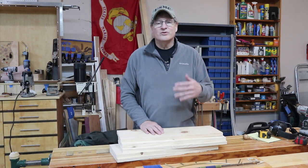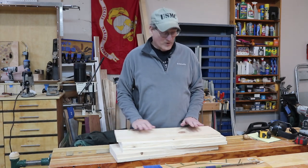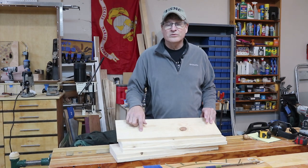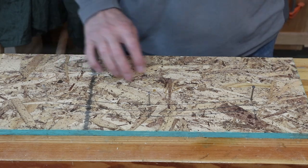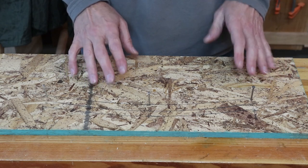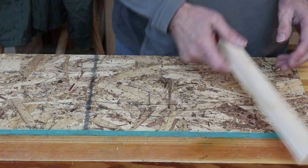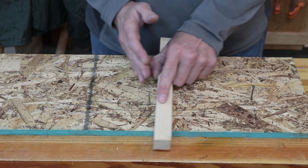I've already done some initial sanding on the edges since they were rough. I'm going to come back and route the edges to make them nice and soft. Then I'll route in the sunburst and an arrow, and come back to do the name on the CNC. What I'm making here — you can see different pieces of wood — is a pattern. I'm making a pattern because I'm making a number of these. If you're only making one, a router with a circle jig will cut these fine by running the router next to a guide.